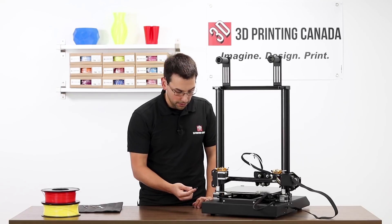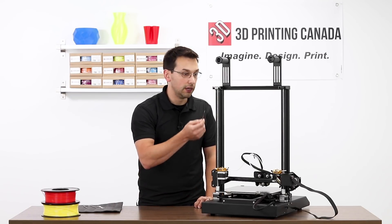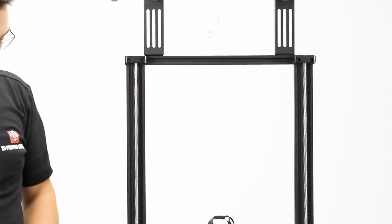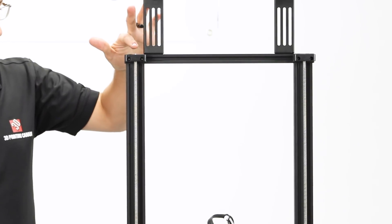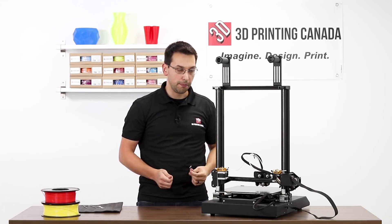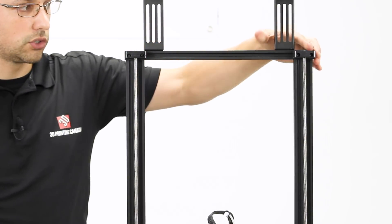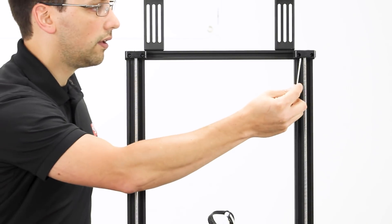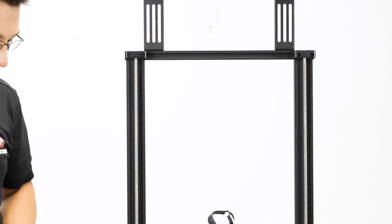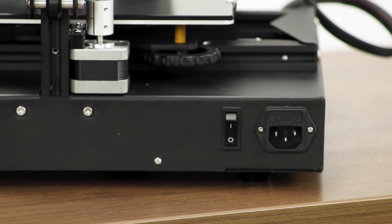Unlike the original promo video released by Creality, they use two stepper motors for the Z-axis lead screws instead of a belt assembly — originally they showed the lead screws mechanically connected via a toothed pulley and belt at the top. One of the lead screws was higher than the other; I tried loosening the coupler at the stepper motor but it would not come loose, so we'll probably replace the coupler. These Z-axis brackets were extremely loose from the factory, so make sure to tighten the screws inside those holes. On the right-hand side near the front you have the micro SD slot and mini USB plug; at the back there's a fused plug and the on/off switch.